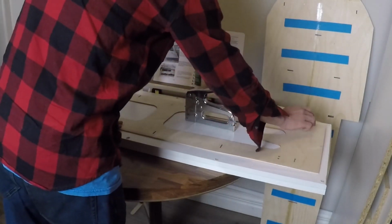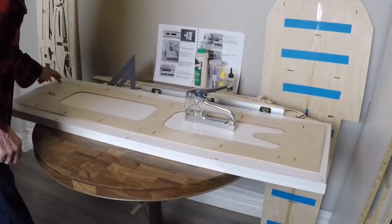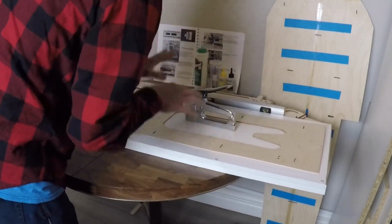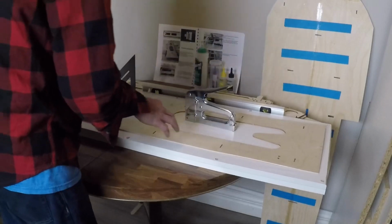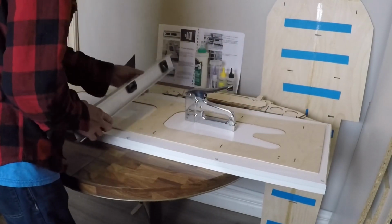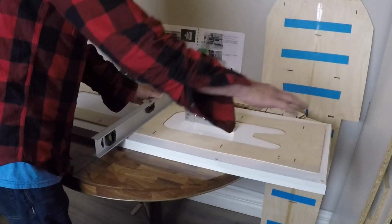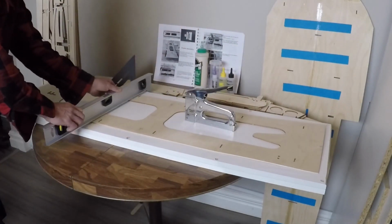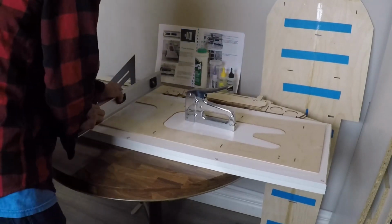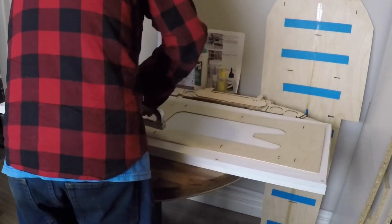As you can see, same thing as with our floor, 1/8 plywood. We have some slight warpage in it, nothing serious, but we have to get it out so that we got a nice level surface to work with. Staple gun to attach it to the MDF with. I put two staples in the center, started right there stapling. In order to eliminate the warpage, I'm slowly going to staple out while I hold the wood down with my level. So, having said that, let's get some staples in this.